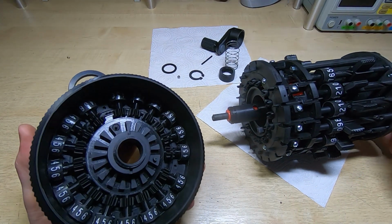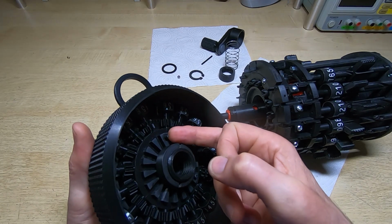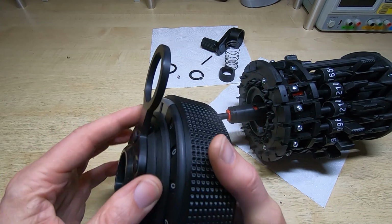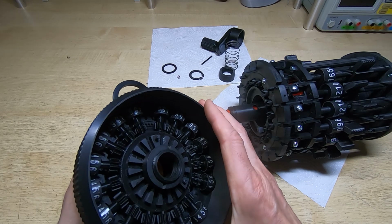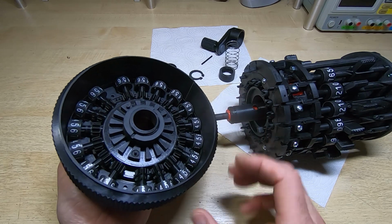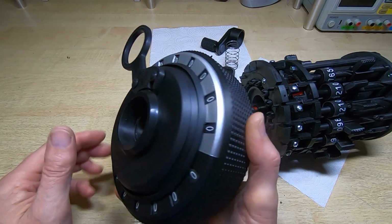Okay, another ingenious lockout is this pin that's sticking out here. It is the bottom of the plunger that's used as the detent control for the clearing collar. So when we rotate this to clear the carriage, you'll see this pin will pop out. So it's now come out. We go all the way around to the next stop position, at which point the pin will go back down again, as it has there, when the plunger drops back into one of the two recesses.